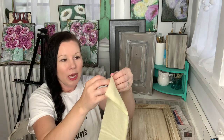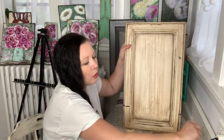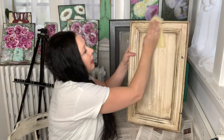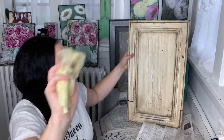These are tack cloths — a great little thing we've added to the website. When you open one, it feels like when you walk through a spider web — it has a sticky component to it and just collects stuff. These are meant so that after you have sanded, you can open it up and collect any debris. So lay your cabinets out, sand them, then come behind with a tack cloth. You can also take a brush to dust anything first — you don't want sand dust in your paint. Grab your tack cloth and wipe it all over. It picks up any dust still left on your cabinet doors. There's the dust from sanding. Our surface is ready and prepped.